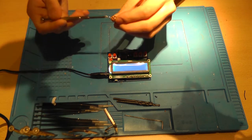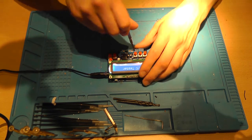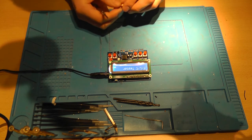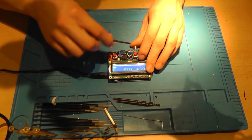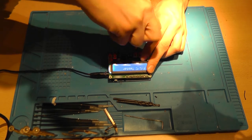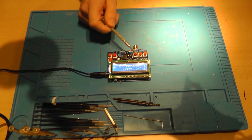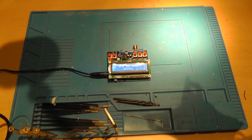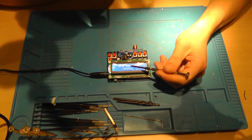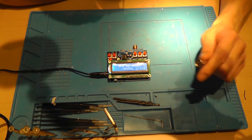If I connect a regular inductor, oh, if it doesn't fly away, to this tester, make sure that I screw it in for completion, and I press the inductance button, you can see that the micro Henrys get displayed, but it's zero, and I don't think that this slash is supposed to be there. So there's something wrong with this thing.